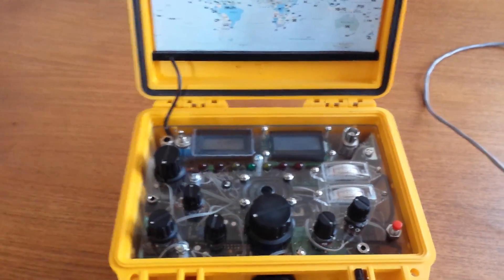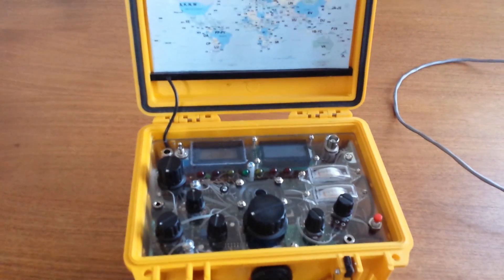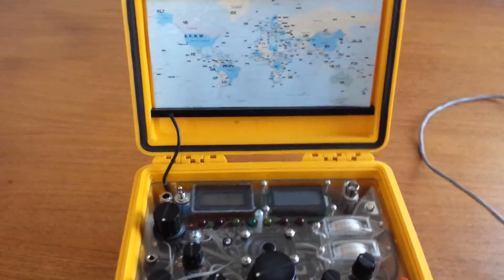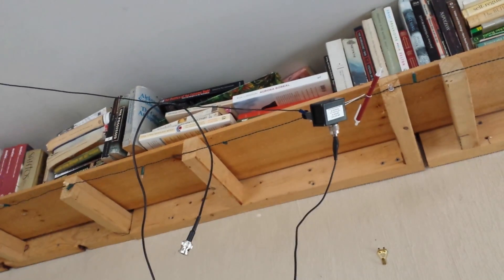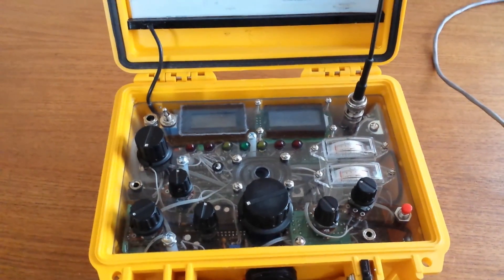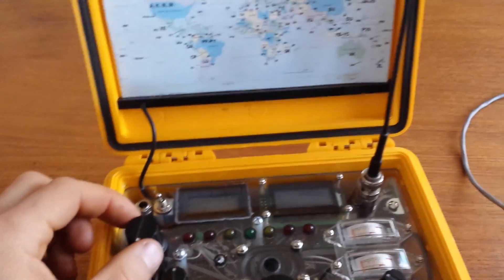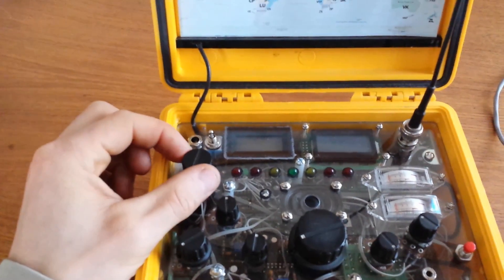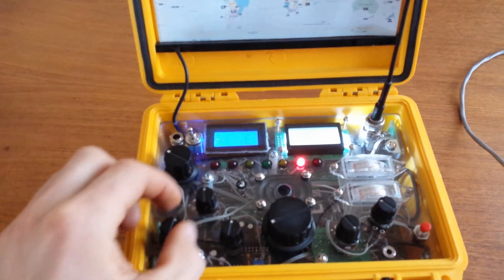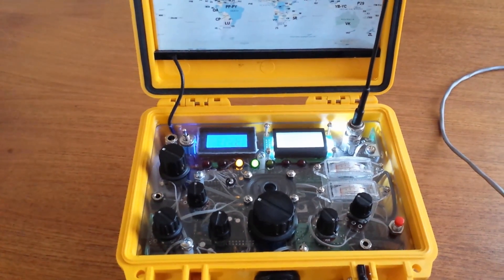There is one more little thing I will show you, but that would be best to demonstrate. We'll get strung up horizontally going across. I would recommend this antenna for this setup for simplicity. Usually when I operate outside I use it vertically, so the radiation is right at the horizon — it works very well for long distance contacts, or DX as it's called. So the antenna plugs in right there very easily. You see the lights light up for the zero beat indicator and you hear 'FB' sent — that means the touch key circuitry is working as it should.